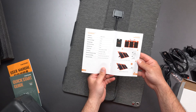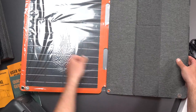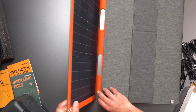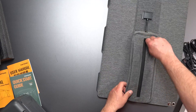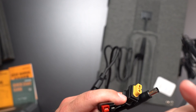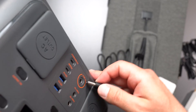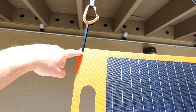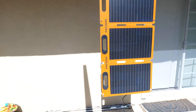The solar panel — that's magnetic, which is cool. Aim it at the sun, don't put it outside when it's raining and you should be good to go. It has back stands. The cabling is inside here — the solar panel comes with three different types of cables, though you can only use one at a time. To charge the power station, just plug the cable in here and into the input, and as long as it's getting sun it will start charging. I hooked up cable ties through these holes to a carabiner and hung it to get full sun — a very nice and convenient setup.